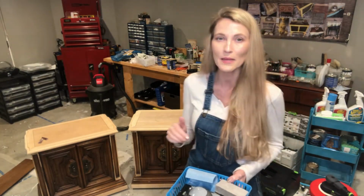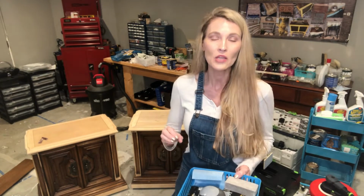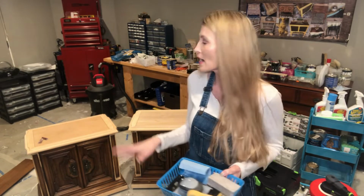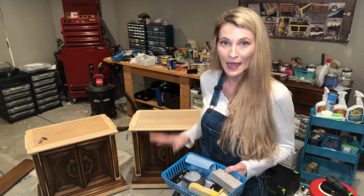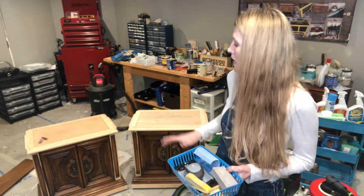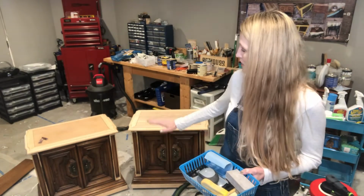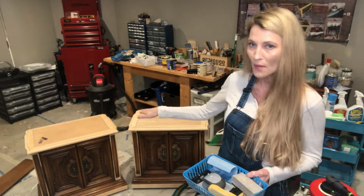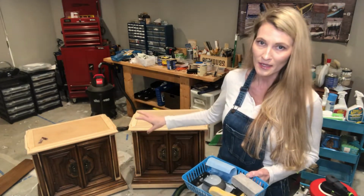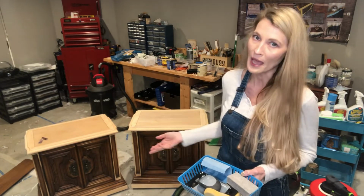And what I'm doing is creating what they call teeth. It's causing it to kind of stand up. That way when I get in there and apply shellac next, that'll be my next little part that I'm going to do on these pieces. I'm going to apply shellac from the top down, not on the top tops, but on the shell of the piece. After I sand it, I'm going to clean it up with crud cutter and then I'm going to apply shellac.